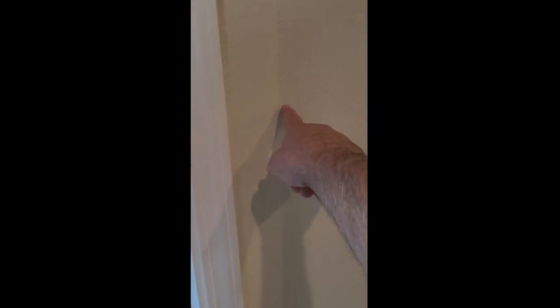I mostly want to match the distance from the side wall on each side. I'm going to try to move it as far right as possible so I have as much space from this little corner area, and I want that distance to be fairly comparable to what it is on the other side. I'll get power for the light in the ceiling of the niche by stealing it from this receptacle, running it to a switch here in the wall, then up to a light fixture.